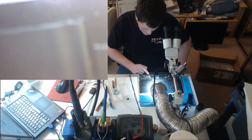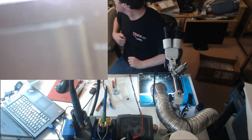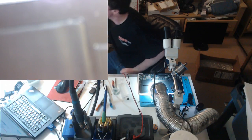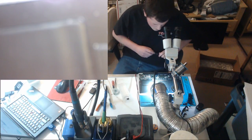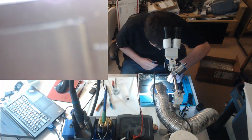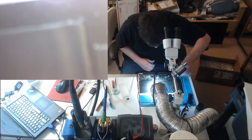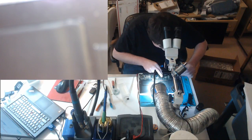Just to note, we have some corrosion by the JTAG connector. So that is a hint that something has happened in that area. So who's to say what happened on the other side of the motherboard? So the T5. Let's start. Let's take the board and the DCM board out and let's have a look.